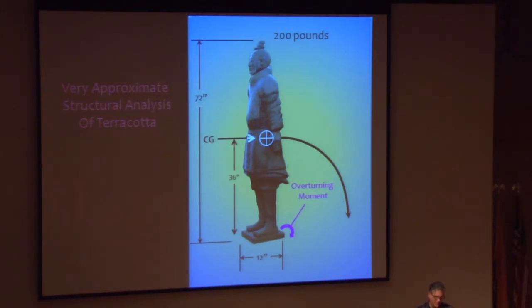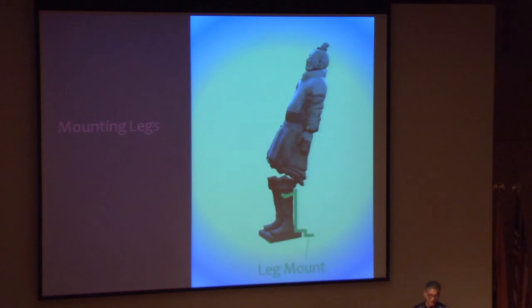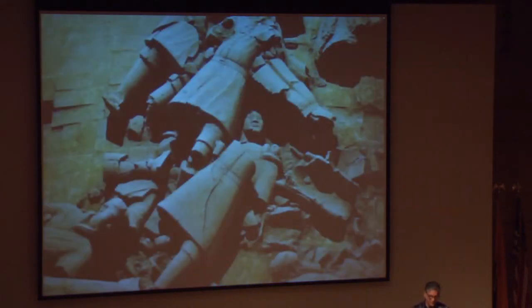In the past and at other venues, we have just bracketed their base or had them held up on posts. Terracotta is much more fragile than bronze or stone. I was fairly certain that bracketing like this would put the modulus of rupture around the ankles. My initial thought was that maybe the legs were stronger and could be mounted in some way, and I also wondered if they could break under the waistcoat — and indeed I was able to find photos of just such breaks.